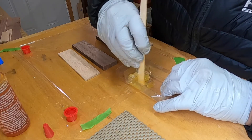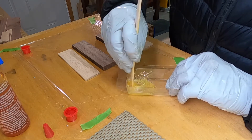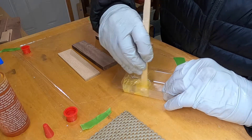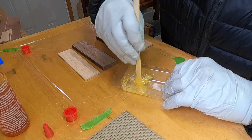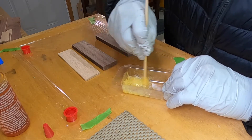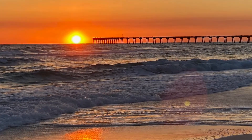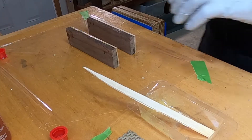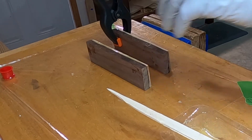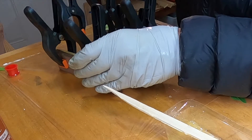Here's the thing with mixing epoxy: you almost cannot mix it too much. Whenever you're working with two-part epoxy, a really good, complete, thorough mix is the only way to go. Since this stuff has a fairly long pot life — it'll stay workable for about 45 minutes — it just pays to really take a minute and make sure you're getting it mixed well. Fun fact about epoxy: it doesn't really require massive amounts of clamping pressure. Just a few clamps and some general pressure is enough to do the job. I try not to get epoxy all over my clamps — that's always a pain.